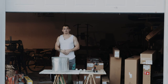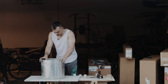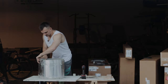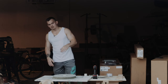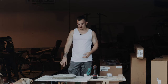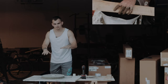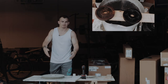It is now day two and it's about 24 hours later. We're going to check out how our weight is doing. It's definitely a little off-center from banging the edges, but that's okay. Let me just take our flashing off. Looks pretty good. This thing's going to be curing for like another four or five days, so it's not going to weigh exactly 25 right now — it's going to be a little heavier because the water is still evaporating. You definitely need to leave the weights on top to keep the flashing tight to the board so you don't get too much runoff, because that's going to affect the shape of the weight.